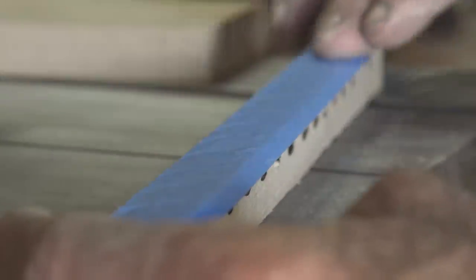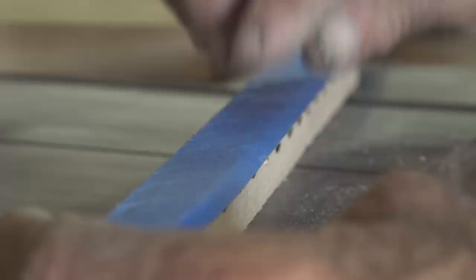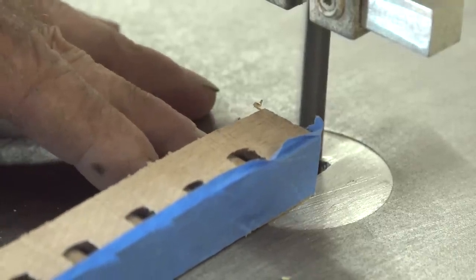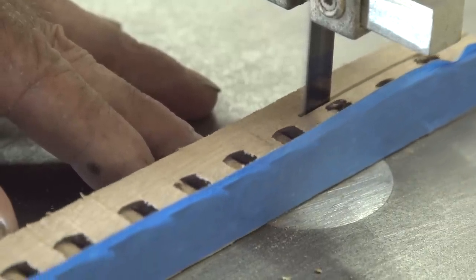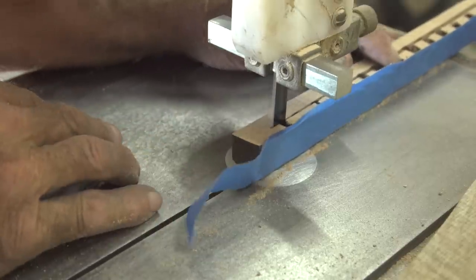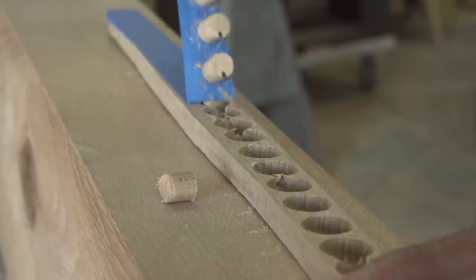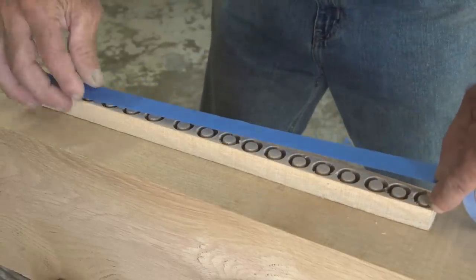Once I put the tape on, I'm actually rubbing it up and down so I can see the impressions of the plug cutter, because I know it's stuck to that piece and I've cleaned all the ends off — it's got adhesion all the way around. You have to be accurate here; you're trying to get the plugs as long as you can, so you cut it close. All the plugs are severed from the piece and stuck to the tape. I pull the tape — it's always fun because they pop right up out of the hole. These are three-eighths-inch plugs, white oak, same material as the cap.